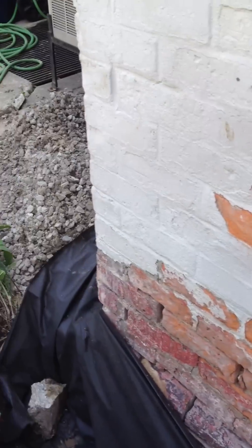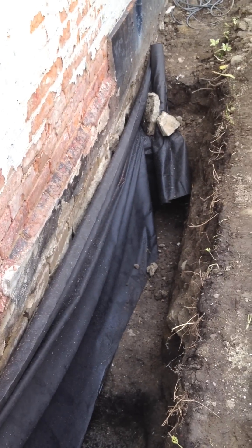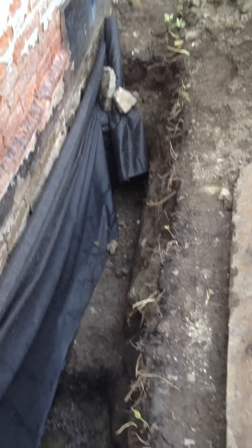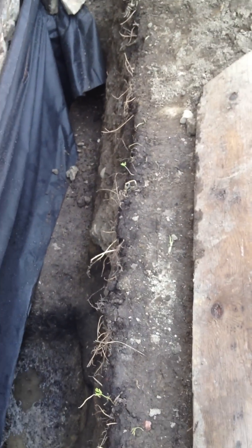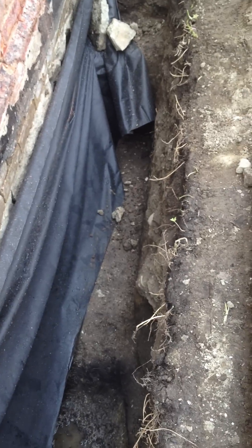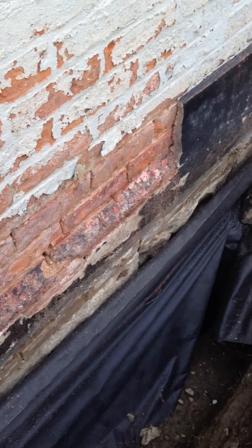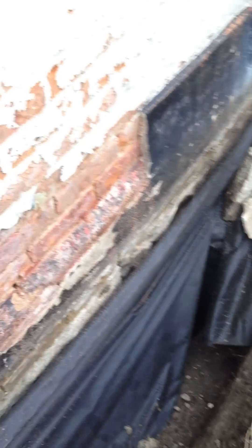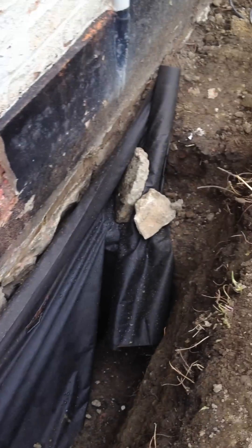This is definitely the most you want to excavate at any one time. For almost all of these projects you should have some sort of professional advisor if you're not familiar with working with these kinds of walls, because disasters can occur. These walls can fall apart, which could condemn a building and injure everyone involved.